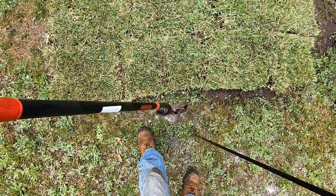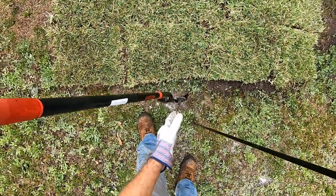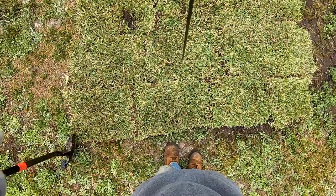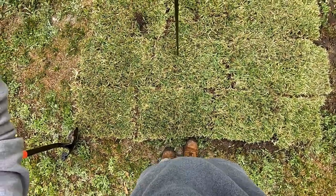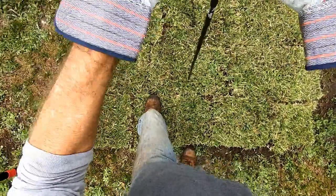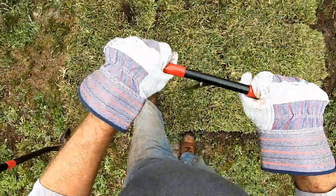Okay, here at the back of the tank — before you just start digging, we know that there's a pipe coming out here. Use your probe and let's see if we can find that. We'll find the back of the tank in the center. You hear it? I'm right on top of that pipe, and it turns right there.